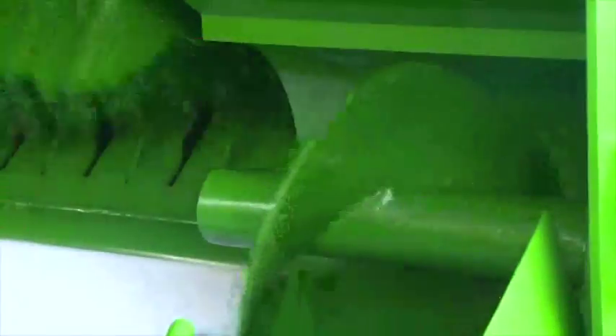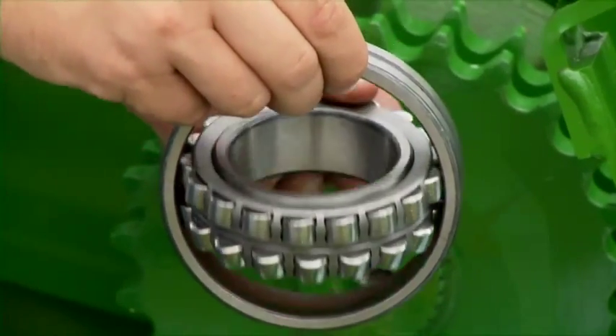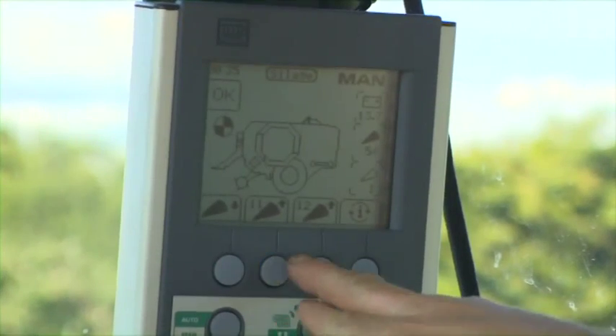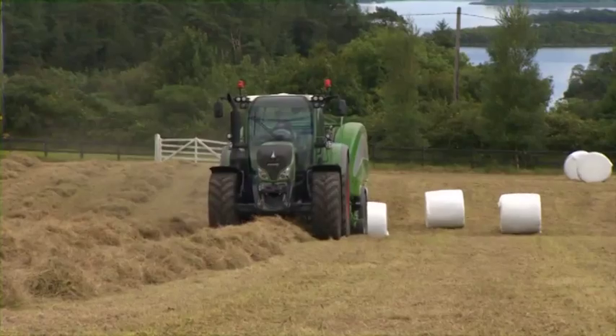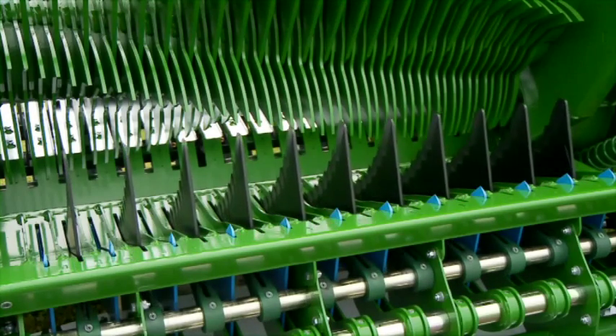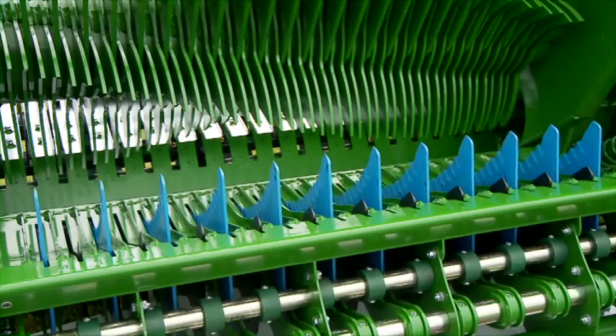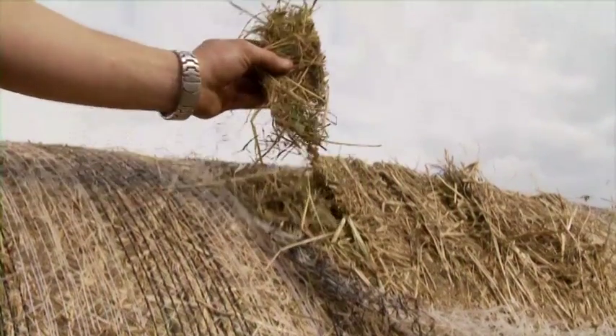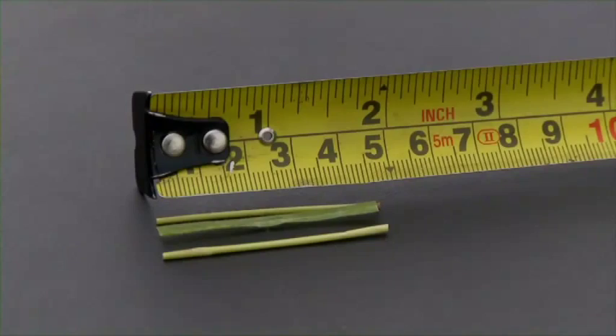As crop passes through the high-capacity pickup, it moves through the feed rotor. The feed rotor, or chopping unit, boasts a heavy-duty rotor and comb. The rotor on all Fusion 3 machines is welded on both sides for superior strength, and on the drive side it is fitted with a double-row bearing with a long service life. The knives can be raised and lowered from the tractor cab to make chopped or unchopped bales. The operator can upgrade to a selectable knife system providing three options: a bank of 11 knives, a bank of 12 knives, or both banks engaged simultaneously for a 23-knife chopper system delivering a chop length of approximately 46 millimetres.